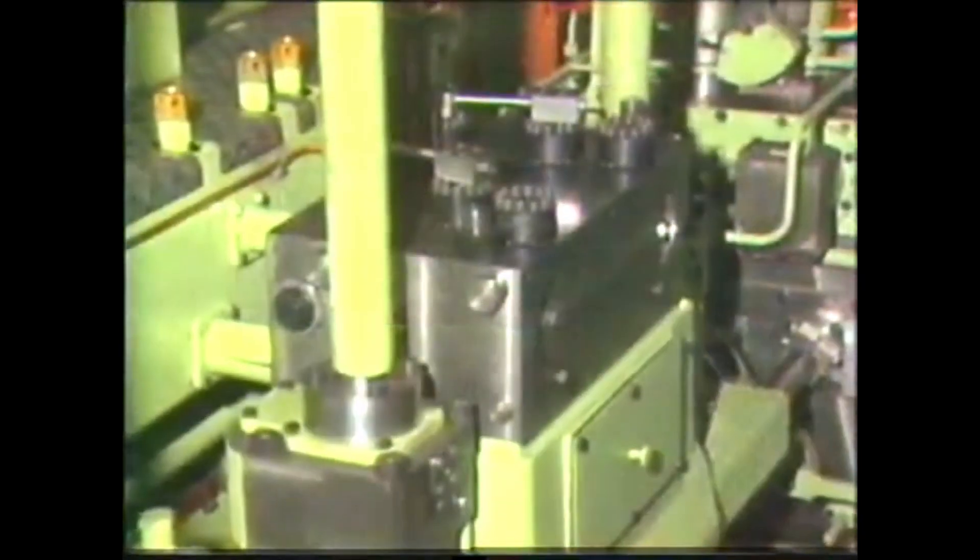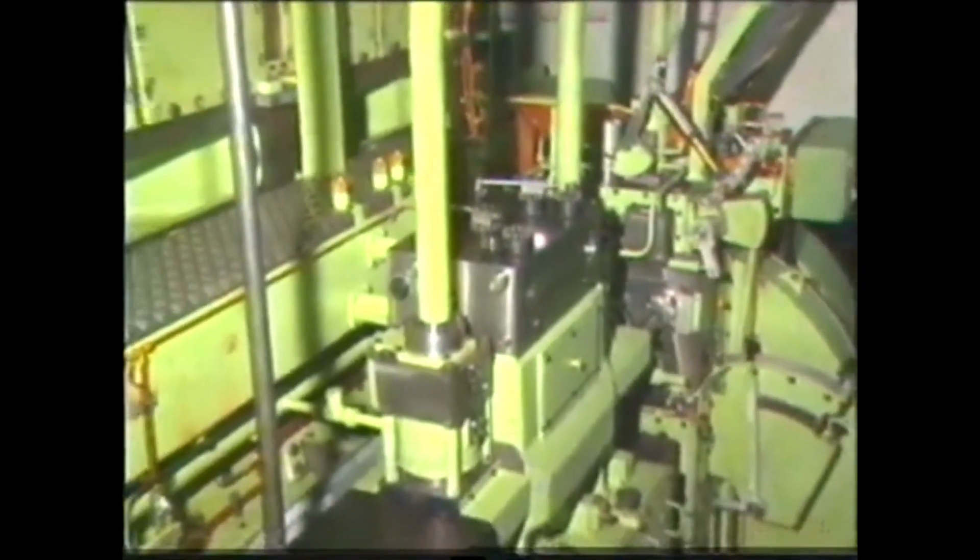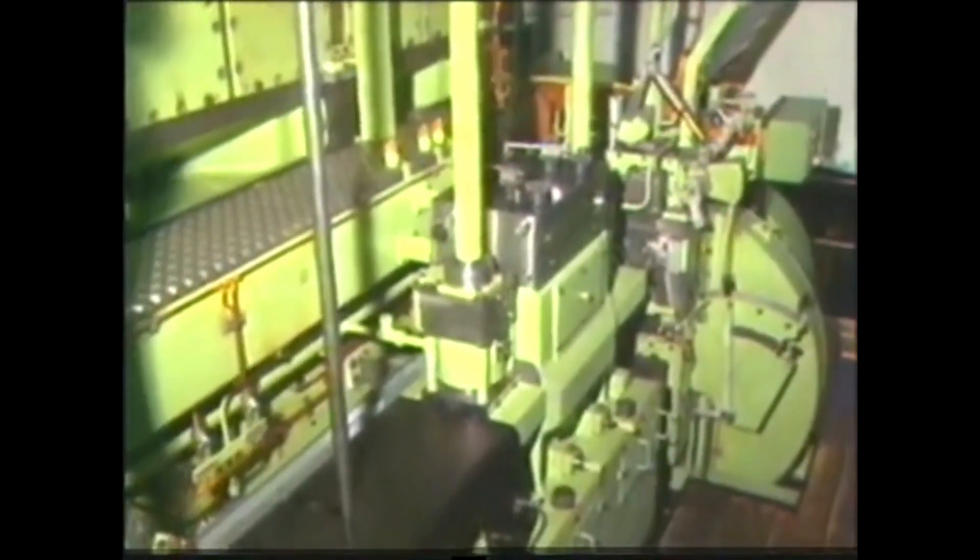The fuel pump is the heart of a diesel engine. It ensures that the right amount of fuel is injected into the combustion chamber at the right moment. The fuel delivered by the fuel pump passes through high-pressure pipes to the fuel valves. The high temperature in the combustion chamber, due to compression of the air, ensures self-ignition of the finely atomized fuel.